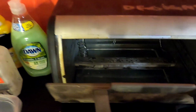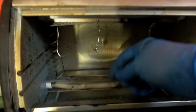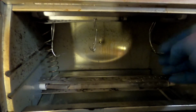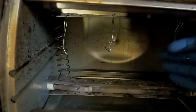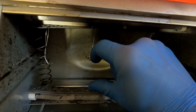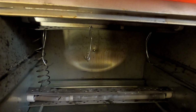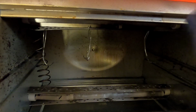And then inside of here, let me just move this out of the way. Another thing I like to do is prep this. As you can see, it's actually broken, the glass, but it's still working. Long story short, there's a little bit of metal with some holes in here, so this is perfect. Every time I powder coat, I practice how I'm going to put the parts inside, making sure I have the correct spacing so the parts are not touching each other. This is very important because this is not just painting. These parts are going to be super hot, and I'll explain why.